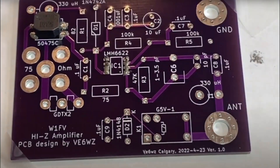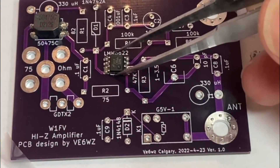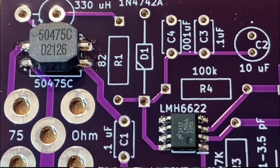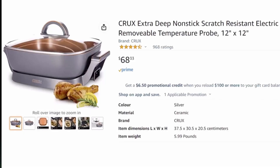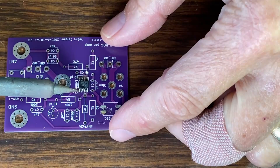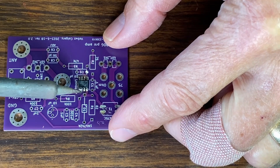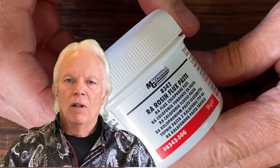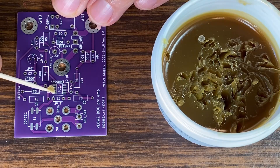The first thing to do is to mount these little SMD op amps. If you do a large number like I do, you might want to watch my video about using a $60 electric frying pan to reflow the devices. You could also use a heat gun or even a toaster oven. However, you can get these little guys on the board just using a soldering iron. First of all, use flux — don't even try it without.